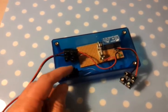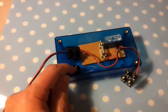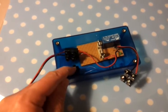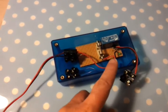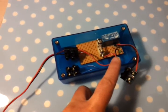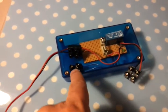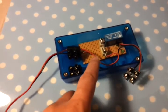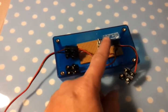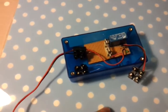The blue connector here is the relay output. It's normally open, so when the normally closed output of the alarm is on, the green LED will light up and signal an enable signal for the inverter. If the alarm is triggered, this lights and the relay turns off, disabling the inverter and shutting down the load. I've taken the precaution of sticking a 125 milliamp fuse in the circuit, since the relay only draws 20 milliamps and the LED another five.